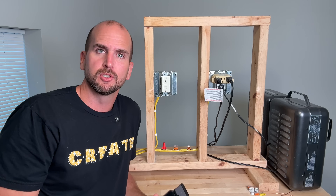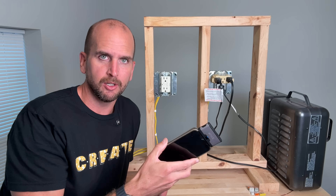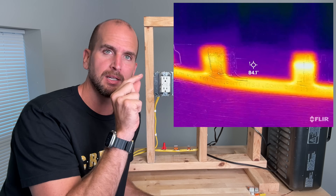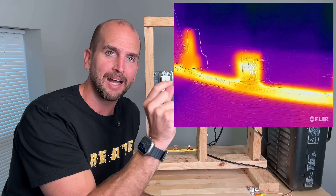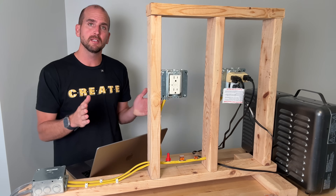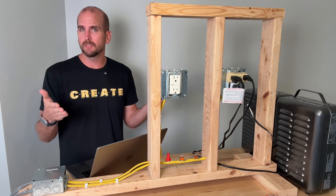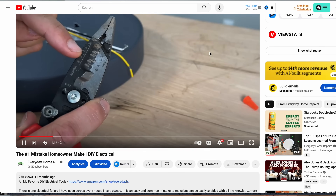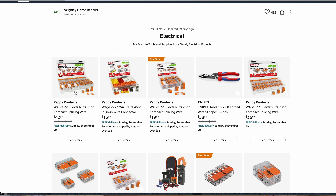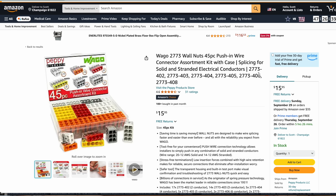The way I get the temperatures is by using a FLIR thermal imaging camera on the end of my iPhone. There's some error in this type of measurement, but we see the whole heat signature and can get the highest temperature in the hottest spot of each connector. We ran five separate test points totaling 25 minutes in duration. You'll find a link in the description for the 2773 push-in connectors and also the WAGO 221 lever nuts, which I think are great for your DIY electrical projects — right below the video.